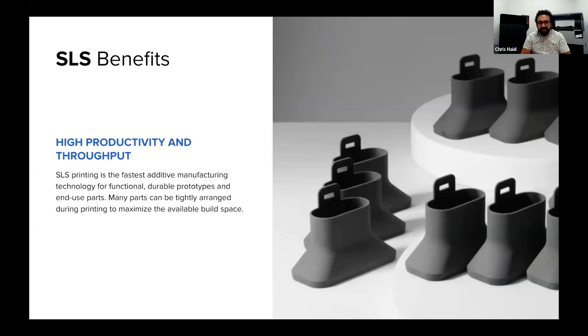One of the big things I really love about SLS is that I can print a lot of things at once, since we can essentially nest parts at will within this powder bed cake. We can stack them up and don't have to worry about parts being suspended one above the other — where on an FDM printer they might knock over. In SLS, we can nest our parts in our powder cake, and you can easily print one part, 10 parts, 100 parts. Some of our customers print up to several thousand parts in a single build. You're able to get a lot of parts out in roughly a day or so.